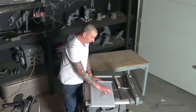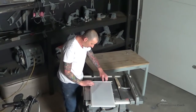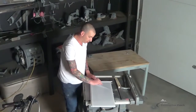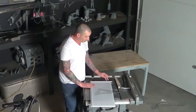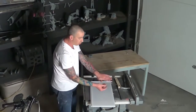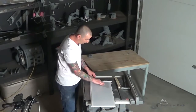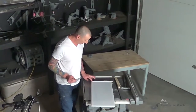I've got both my pieces pounded in. I've got a plastic square here, and when I line it up into the corner, I can see that my plastic square is sitting perfectly square. That means when I tape a piece of paper on here on these lines and use this square on those lines, I'm going to be drawing perfectly square lines with each other. Now I'm going to trim these edges off, cut this corner off, and belt sand it down so that when I ride the square this way, it doesn't hit the corner — it bypasses it and allows me to work the square that way.